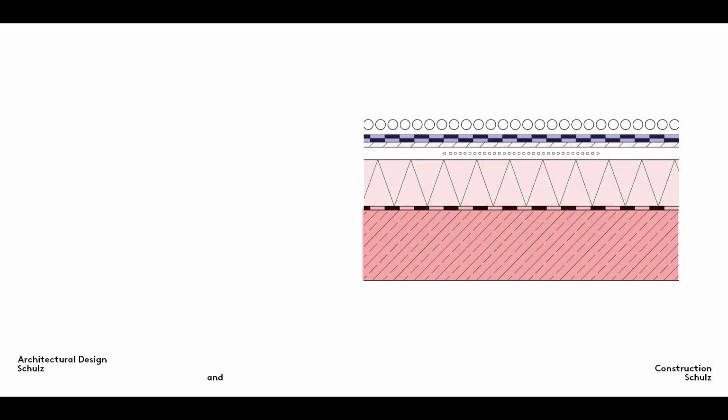This type of construction is called a cold roof because the waterproof membrane is laid on the cold side of the roof. The temperatures above and below the membrane are almost identical due to the ventilation gap beneath the sheathing. The insulating effect of the layered structure ends at the top surface of the insulation, with the water-bearing layer running exclusively on top of the waterproofing.